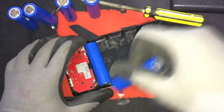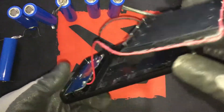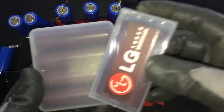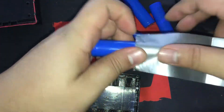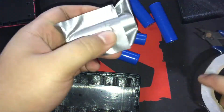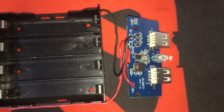That's the third, fourth, fifth, and finally the last one. Let's see if our module will fit the case — perfect! Now we just need to remove the battery case attached to our module, add it to the enclosure, and put in the batteries. I've got 6 pieces left. Before we throw the old batteries away, we need to remove the wires connected to them and wrap them with something to lessen the potential of shorting, then place them inside a jar or box to protect them and prevent heating, burning, or even exploding — because although the chance is quite low since they are basically dead, there is still a possibility.